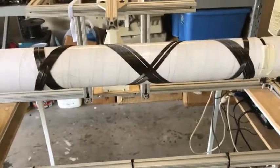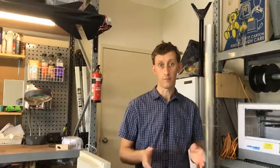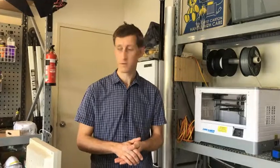As you can see, there's a lot of work in this. There's also a program behind the scenes that I wrote — you tell it how long you want the tube to be and it will generate the G-code that this computer uses to send to the motors. There's also a lot of math behind it. It's basically a geometric problem that you need to solve: how far away the carbon fiber is from the mandrel, how wide the mandrel is, the diameter, and what angle you want to layer it. It's quite challenging. But hopefully soon we'll have some carbon fiber tubes that we can use for our other projects. Thank you for watching.